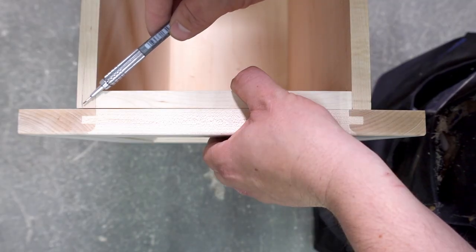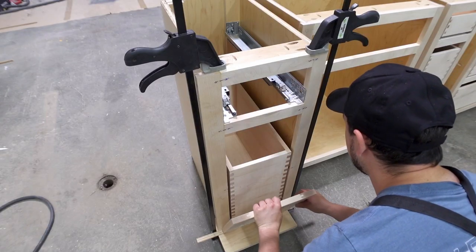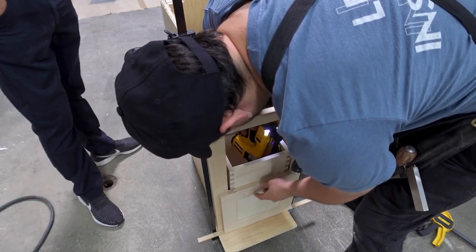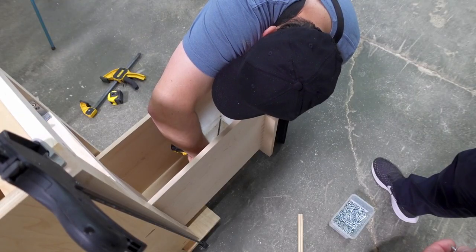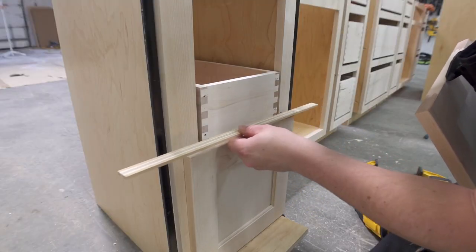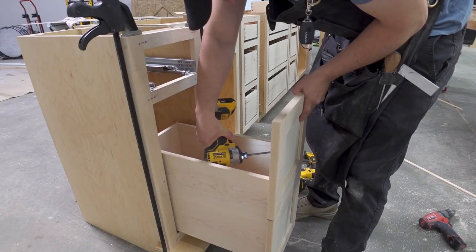And by the way, the screws are drilled angled so they screw into the stiles. Then the first one can go on and be pinned from the back. Four screws lock it on for good. Now the 3/16 shim can be placed and the next face can be attached to that same tall drawer box.